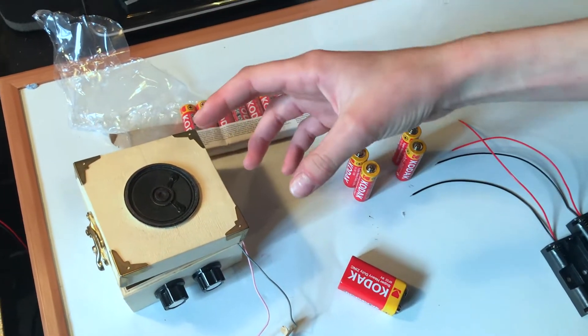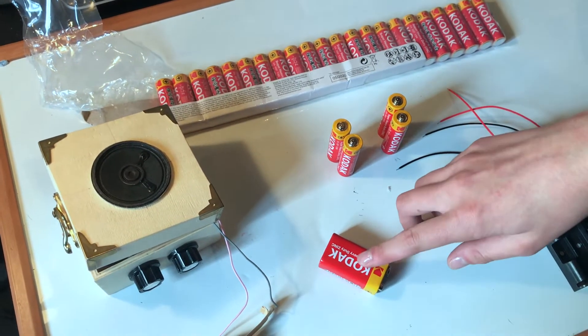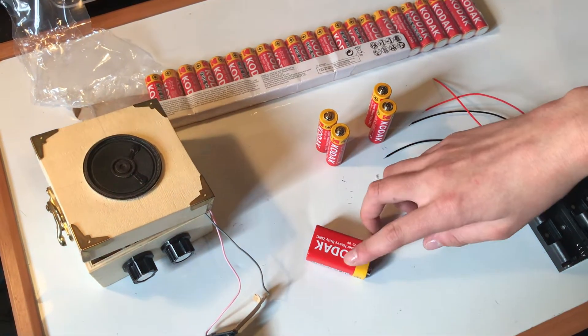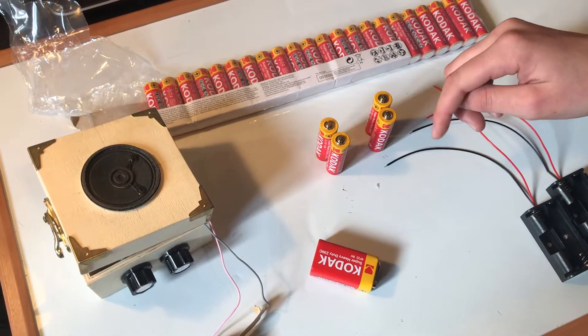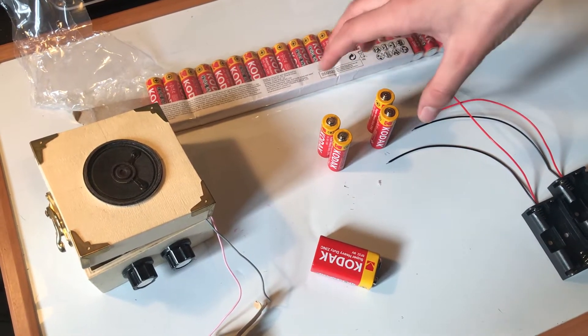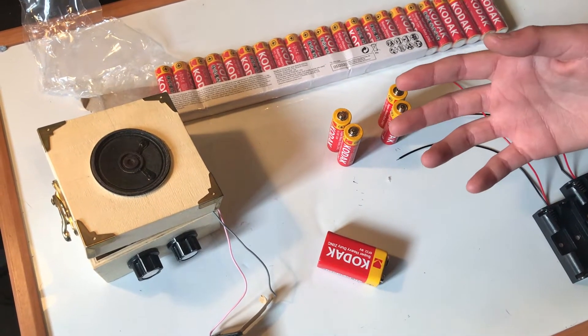This needs between 4V at a minimum and 12V at a maximum, and we've been using this battery and that's 9V. So if we were to use these, one of these would give us 1.5V, two of them would give us 3V. If we use four of them, that gets us over the finish line and gives us 6V, which is what I've decided to go for.